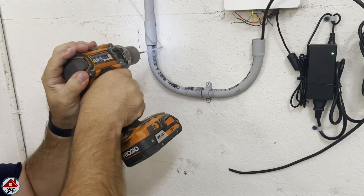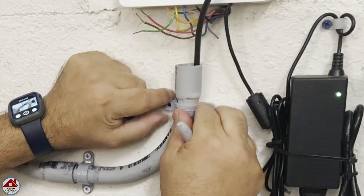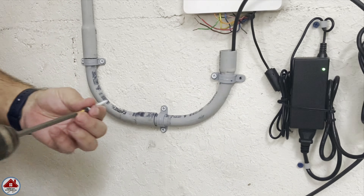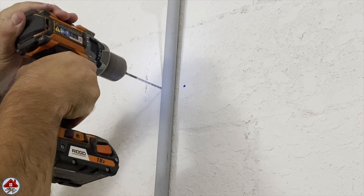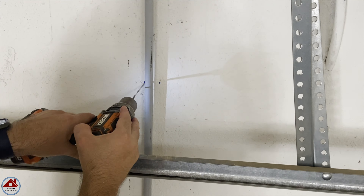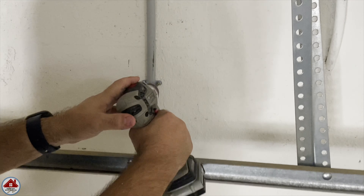What we're going to do next is feed the wire through the attic and back out down to the sprinkler valves. Then I'm going to show you how to test your wires by doing a continuity test that fails on the old wire but works on the new wire. Then finally installing the new sprinkler valve boxes. So I finish up with the last clamp — here's a shot of how it all came out. The wire is nicely protected in the conduit.